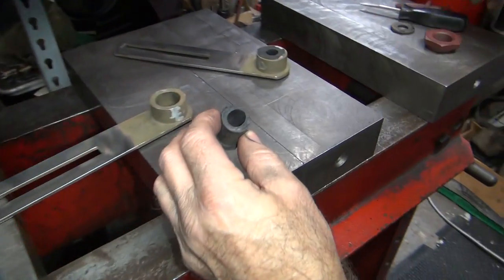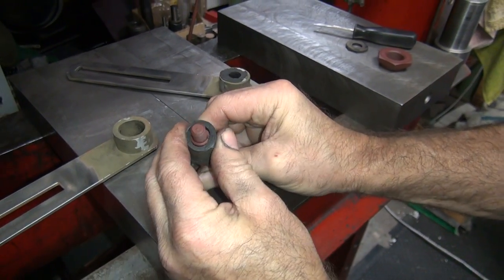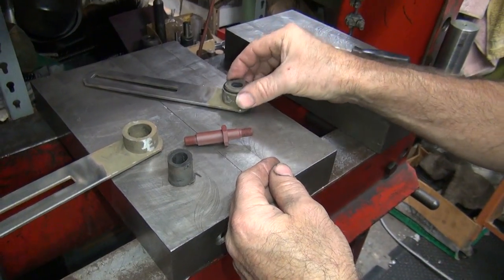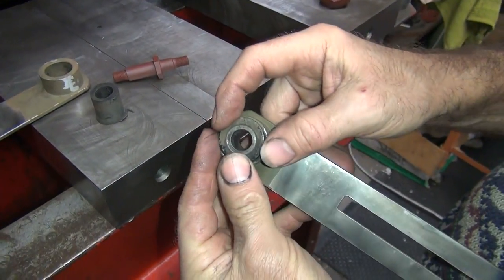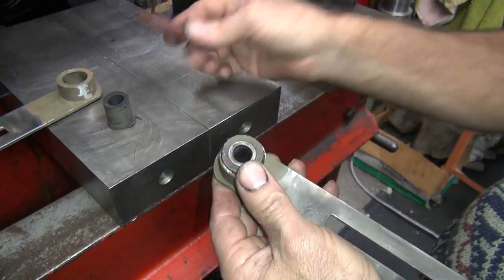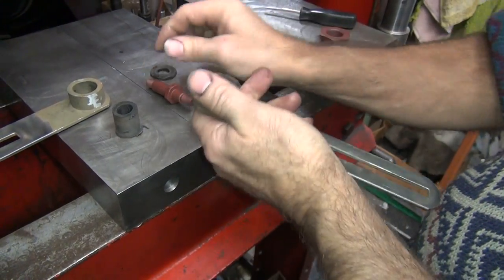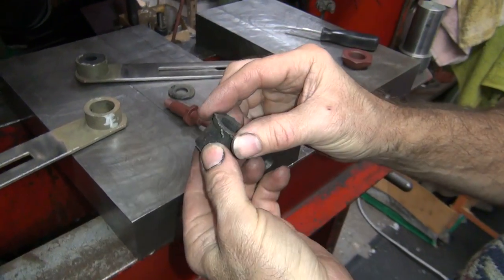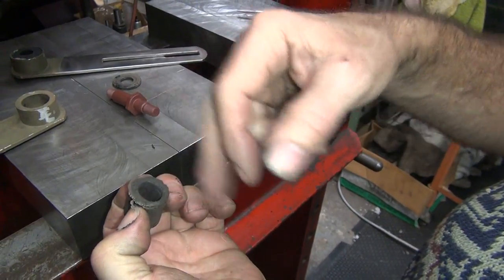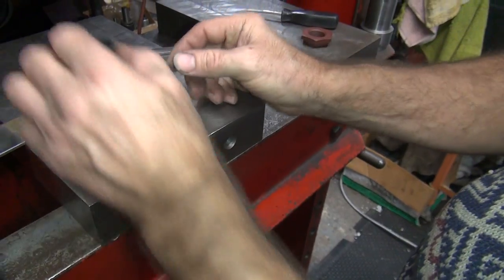This rubber here was worn out. Appears to be a little loose. It was going up and down. This other one had a washer over here, which looked like it was steel inserted, but it was actually a rubber washer when I popped it off. So I guess that held it, so this stud here didn't hurt it. This one here didn't have the rubber on it, so it just squeezed the rubber out to one side here, and then the bolt was free to go up and down, and it beat the hell out of it. This rubber is kind of petrified.